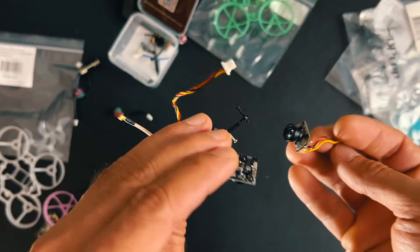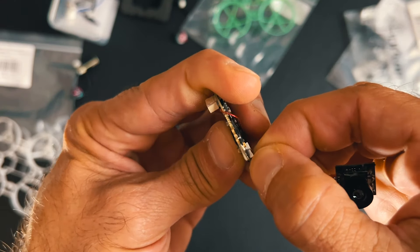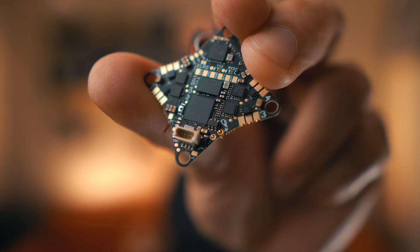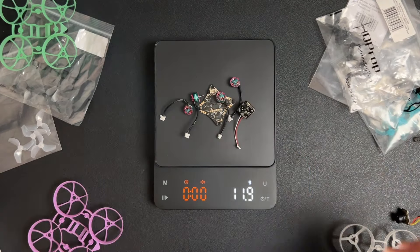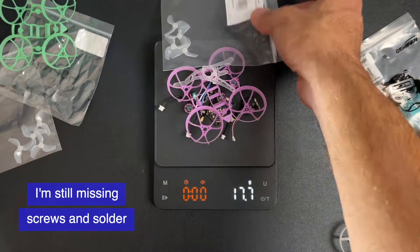The last part is the camera. I have a few analog cameras laying around, but I really like the quality of the BetaFPV C03, and I know it comes with a plug that fits this all-in-one board I've already chosen. Building this tiny whoop can be seen as a simple thing if you think you're just gonna have to solder the motors to the controller and the power cable to the controller, or it could also be seen as something quite difficult because the pads on this board are not the biggest ones. I'm really hoping this build comes in under 20 grams. There are more things you can do to lower the weight, but I'm gonna try to do it this way — very simple and straightforward.